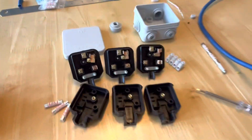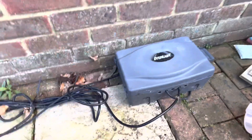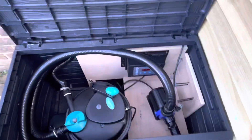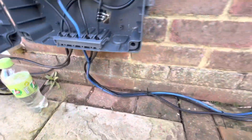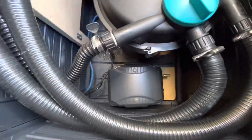I'll show you how we're going to be wiring this into the outside. I've got a circuit breaker there, a wire through the wall which comes through into one of these classic Ever Ready waterproof boxes. I'm going to mount that on the wall about there, and then come inside the filter house and get it all wired in. That's mounted on the wall, all labeled up — liking my matching plugs. I'll put some cable ties on it for the meantime just to keep it all together, with a bit of slack, and it all goes underneath that shelf with the air pumps down.